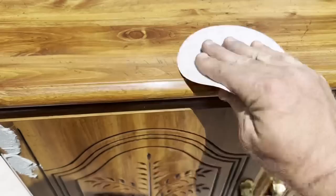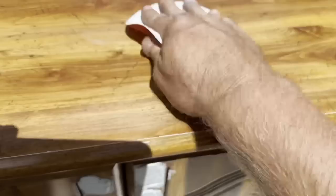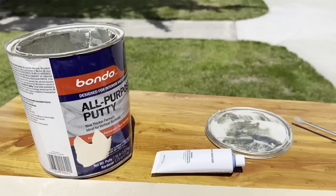Just some quick scuffs. This is 220 grit sandpaper over the top of this. Essentially, it's a paper-like veneer — it's made to look like wood, but it's basically a printout. A very good printout. And I'm just scuffing this up, just a couple minutes of sanding, not going crazy, not trying to get through it, not using the sander. The orbital sander would cut right through this.